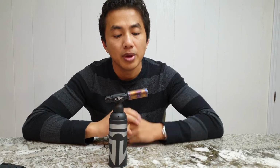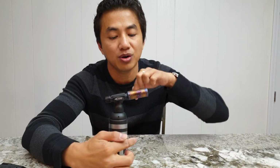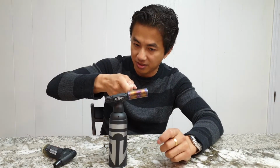All right, so in order to get it to have varying colors but not dilute the whole entire thing, for this particular bezel, I heat the center of the bezel first. You want to heat the center of the bezel first, because it takes the longest to heat up. You don't want to hold the fire to it the whole time. You've got to keep on spinning it around and evenly heat the bezel or the surface of the metal all around.